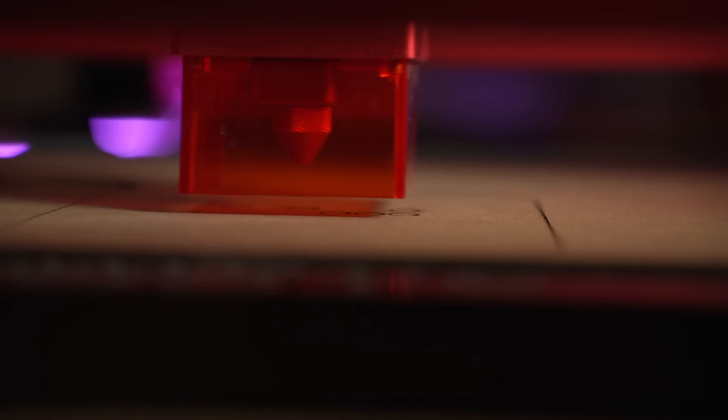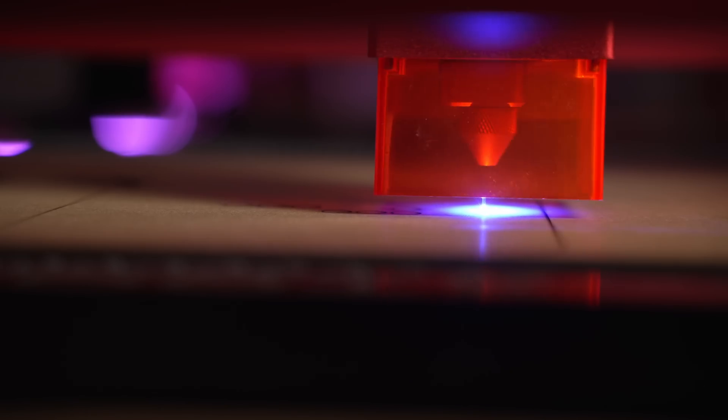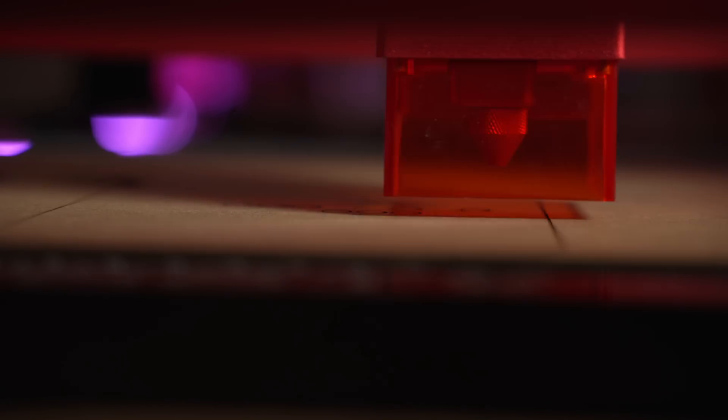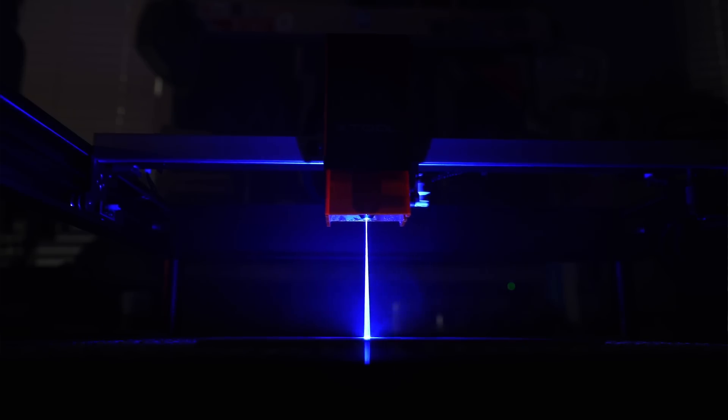Be super careful especially when using diode lasers. They'll give you safety glasses which help filter some of the light — that laser diode is going to be visible light and it's nasty to look at even if you're nowhere near the beam itself. That's another good reason to have an enclosure. This kind of gets glossed over when you look through the product description, so be super safe with those laser diodes.